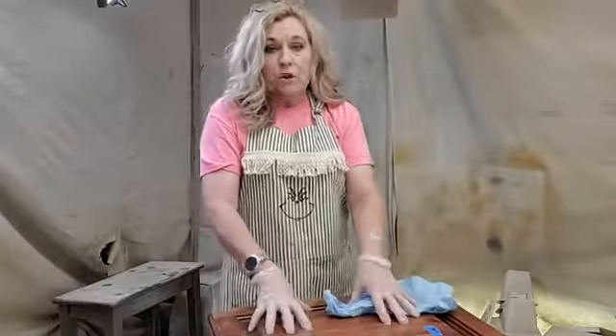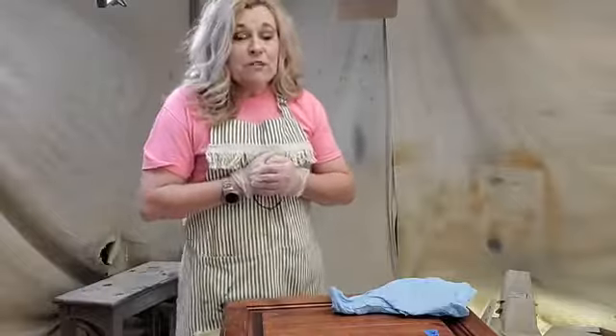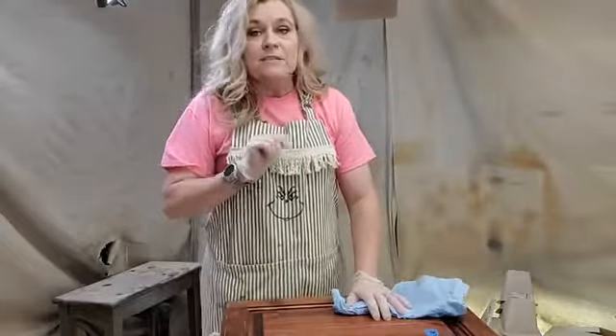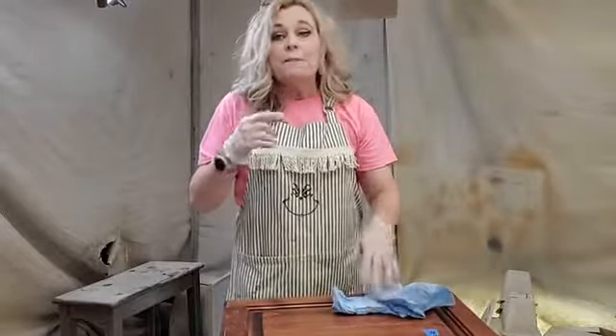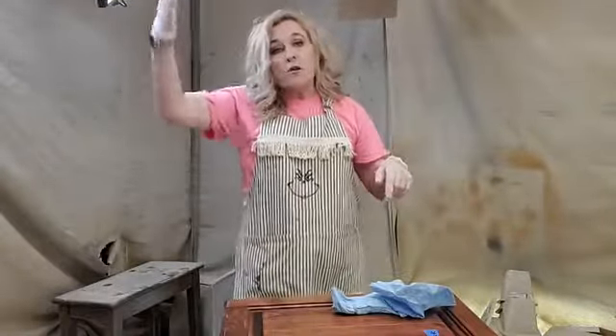That's just addressing the doors and drawers. When you're going into your kitchen to paint, I have sad news for you — the first day you usually don't even get to put any paint on anything. The first day you should go in and clean everything that's attached to the walls. Not inside the boxes — that's usually not included in a standard paint job. You want to clean everything and then tape and drape. Before you even start cleaning, the first thing you do when you walk in there is protect all of their stuff. Especially if you're painting for somebody else, tape everywhere your cabinets meet the wall or the ceiling.